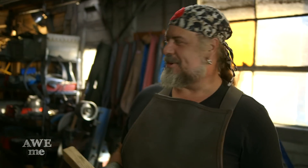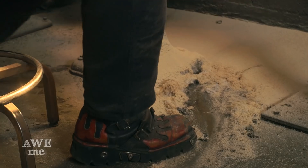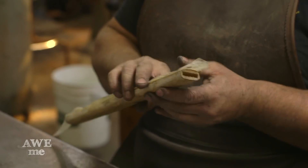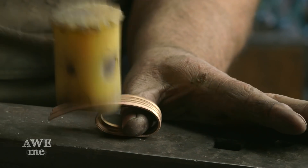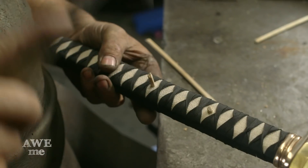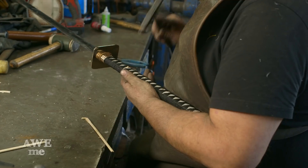In order to make a proper grip or handle for the Sephiroth, I'm going to use this chair leg. We had a bolt on the end, repurposed it. We milled out the interior for the tang to fit in and press fit that. Once that's shaped up, it gets covered with same, which is actually stingray skin. We'll wrap that with nylon cording in a katana wrap crisscross pattern. I took a sheet of bronze and ran it through the Pullmax machine to make a triple beaded bezel that will wrap around the top and bottom edge of the grip. The handle will be pinned together traditionally with a bamboo pin — and the best thing I found that works is chopsticks. We had to go to a sushi restaurant and keep dropping chopsticks so we could pick them off the floor and take them in to use for pinning the handle together.